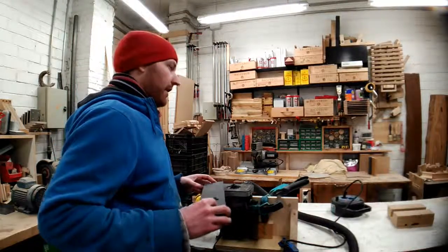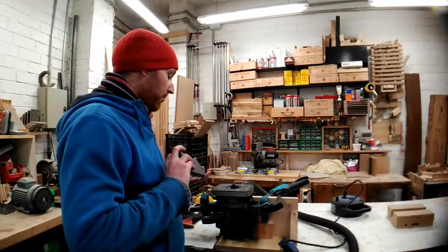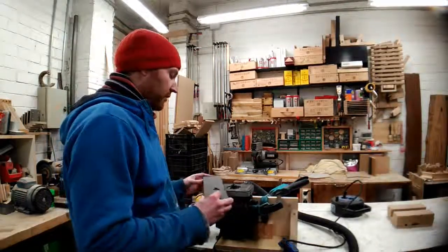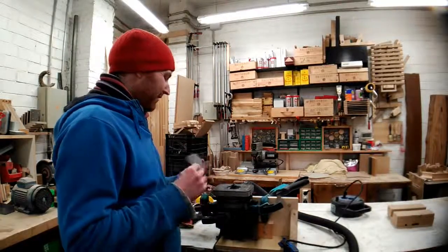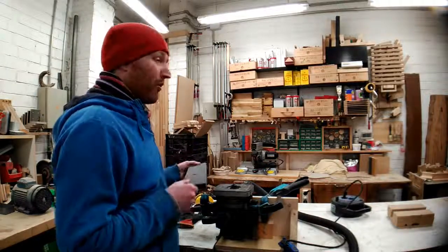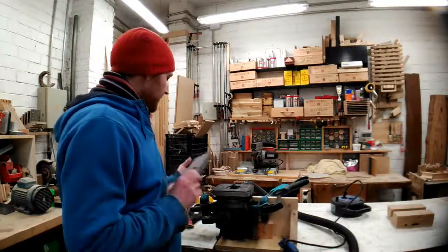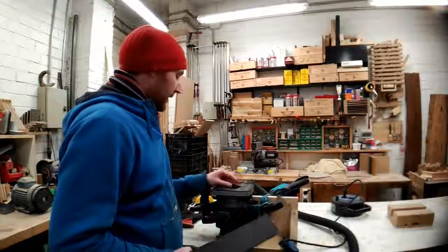You go in the wrong direction, and you'll be essentially trying to do a long back cut. What will happen? Well, the piece will probably jump. That's not really what you want. So to avoid that, you can just do a little test cut, a small incision, and the tool will tell you. You have to have a little bit of sensitivity to what the tool's trying to tell you. If it's making weird noises, if it's starting to jump, if it's vibrating more than normal, probably you're moving in the wrong direction.